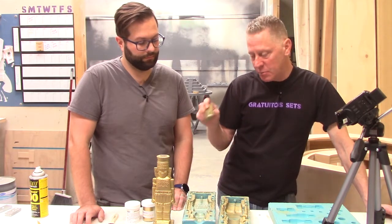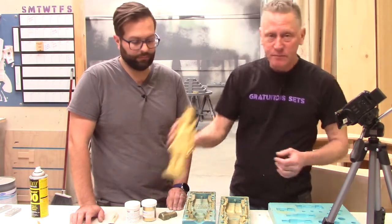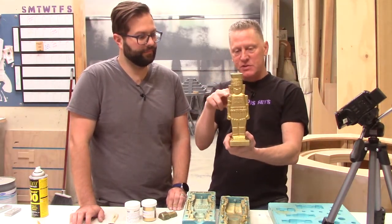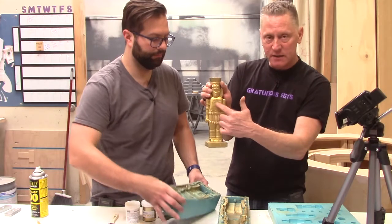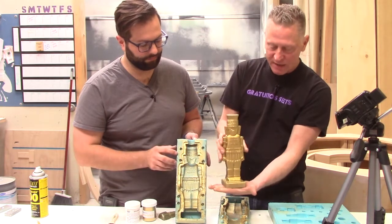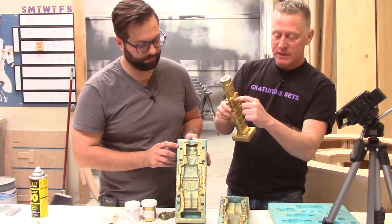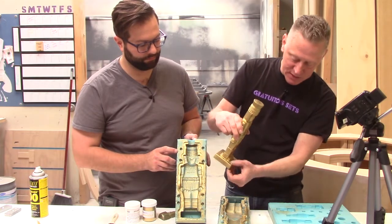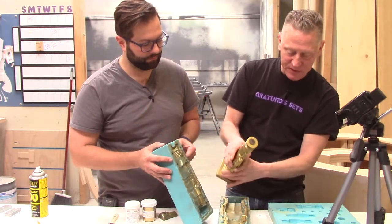So we're going to go ahead and dust the brass powder into this mold, pull a copy, and see what we get. Now, one of the other problems we ran into, starting disaster, is as we poured this, there are horizontal surfaces, the tops of the shoulders, tops of the ears, tops of the base, and there's all this detail in here. And pouring this guy vertically, just pouring him in through the top, he caught bubbles throughout the decorative work in the chest piece, top of the belt buckle, top of the base. You can see this here. And there's a nice bubble in the top of each shoulder.